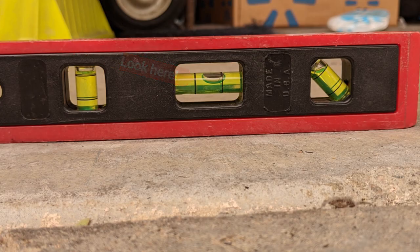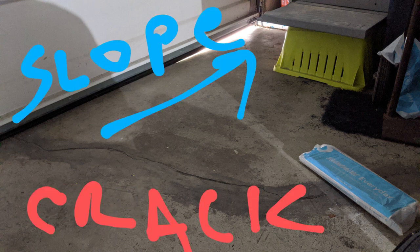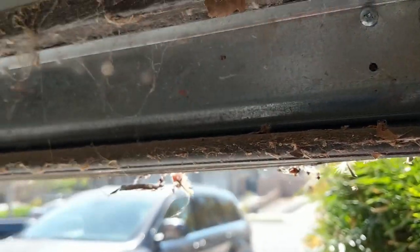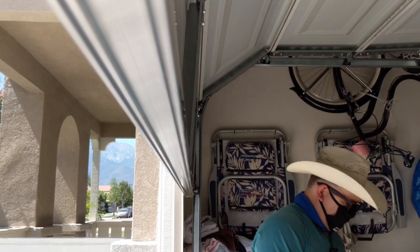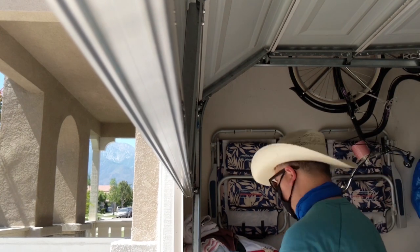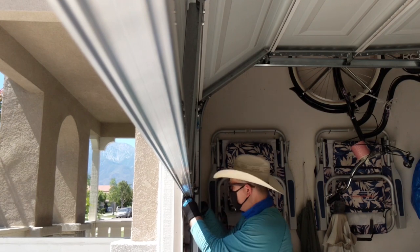If you see cracks in the garage foundation, then it's more than likely that a new astragal, also known as the bottom garage door seal, won't work completely — there still might be a gap. So do your homework and be thorough before replacing the seal. After carefully taking off the old bottom weather seal, make sure the bottom section is cleared from all dirt and debris. You should also spray lubrication slightly into the channel of the bottom retainer to help facilitate the installation of the new weather seal.